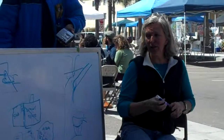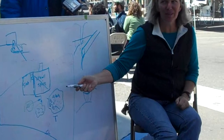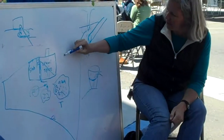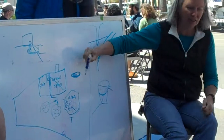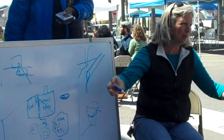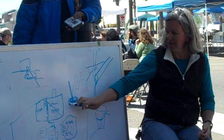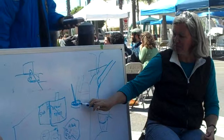One of the things he required for my washing machine, which was a really small amount of water, was a mulch basin. I have it go out to banana trees. The mulch basin that I put in is 25 square feet and 1 foot deep, which is overbuilt, but it made him really happy. I ended up growing banana trees in that area, and then I created an overflow, so if it was too much water, it goes down to another mulch basin.